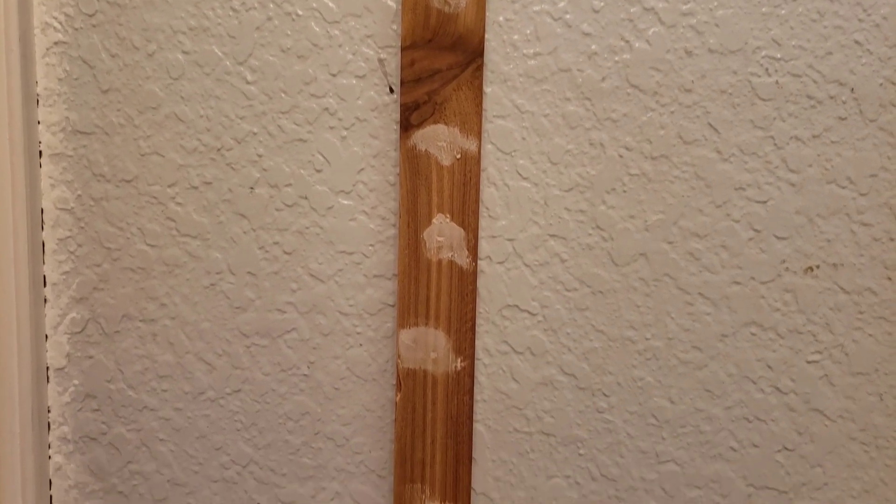Because I had no glue or adhesive for the boards, I put a ton of nails into them just to make sure they'll be okay. Maybe in the future I'll pull them off and put some glue on them, but for now I used joint compound to fill the holes. I'll let it dry — it might sink in a little bit and then I can do it again. I did it to the boards as well. I know it's pretty messy, but I can just sand or wipe it down.